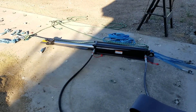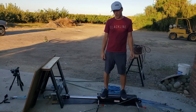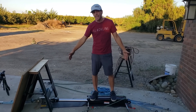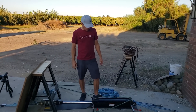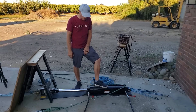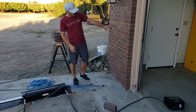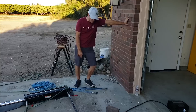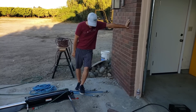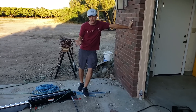Now we're breaking things in shear. What we have here is a 5-inch hydraulic cylinder with a 2-inch rod and a 24-inch stroke — that's quite a bit of oil, about 4 gallons. I like the tie-rod style because it lays flat. Equalization is a myth, but it works well enough. We use the equilateral triangle setup — if you're curious why, watch the 20 episodes I have promoting it. This is a 10-foot long soft shackle made of Dyneema, which doesn't equalize perfectly but has no friction, so it equalizes as well as equalization is going to happen.